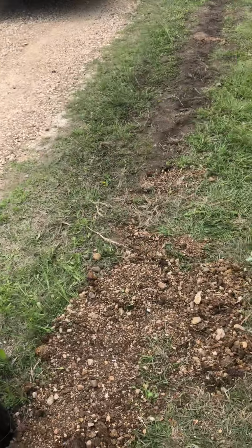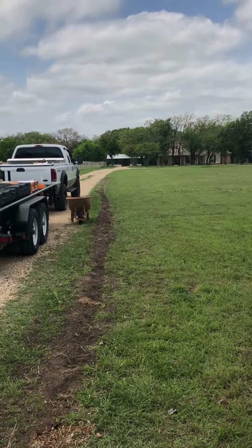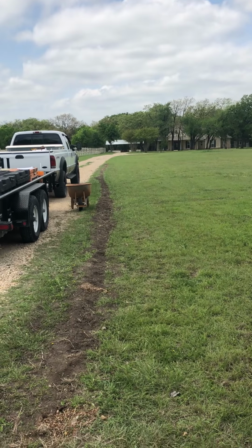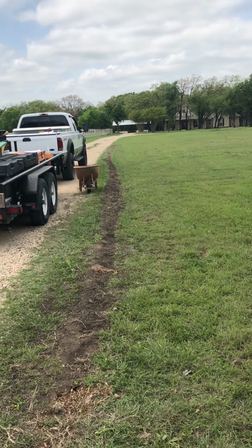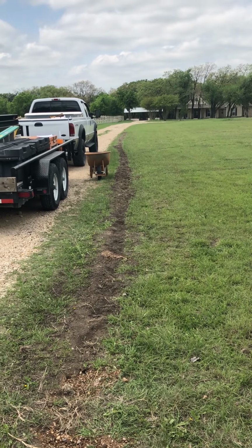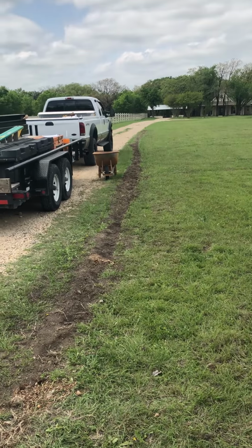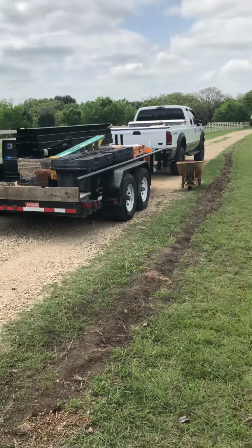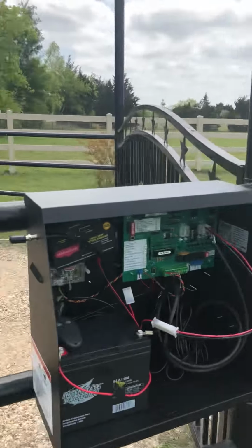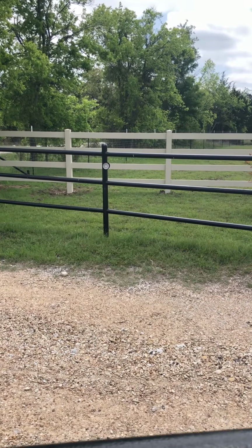The last thing we have on the gate is going to be the CarSense 3-wire probe. Comes with a 100-foot installation, so that's buried 100 feet back. And when we're done installing, we will test the exit probe to make sure that it opens. So we've got inside protection when people are inside, when the gate is in open position, and our protection for outside is going to be the photo eye over to the reflector.